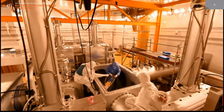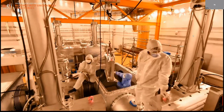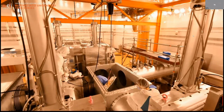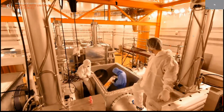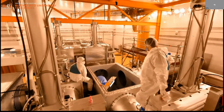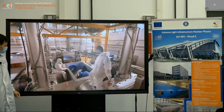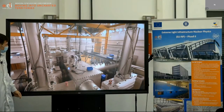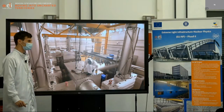We had to unmount the hollow mirror, remove it, and then place back the new fully flat mirror, connecting all the motors — especially the LEDs to measure the diagnostics of the mirror. We see that the mirror is illuminated here in order to see the defects of the coating. Then we clean around the chamber and lock down the chamber again with the 72 screws that are around the chamber.